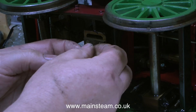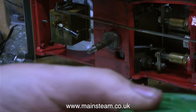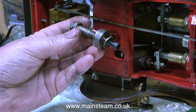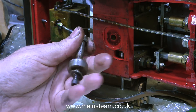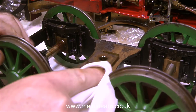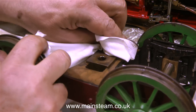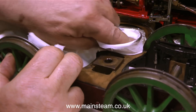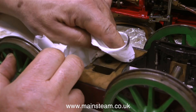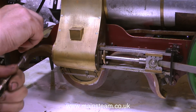I'm taking out the entire unit — not just the bogey wheels, I'm taking out the spindle as well, because I want to see how it's all put together. The good news is it's really well made; I've not found anything wrong with it at all. I think this is a good design — a high-tensile allen-head bolt is used to securely hold the pin to the frame stretcher. All of these parts are going to need thoroughly degreasing. Normally I just put them in a tub of cellulose thinners, but that removes paint, and I don't want to remove this paint because it's very well stuck to the metal.